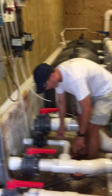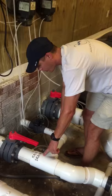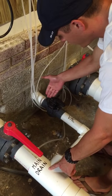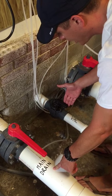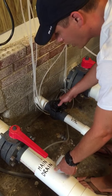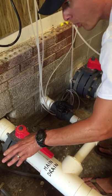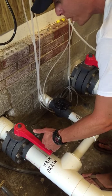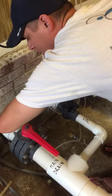They need to be properly labeled. This is labeled vacuum, this is labeled main drain. For the vacuum, if this valve is in line with the piping, it is closed. For all other valves on this pump, when the valve is in line with the pipe, it's open, and when it's perpendicular, the pipe will actually close.